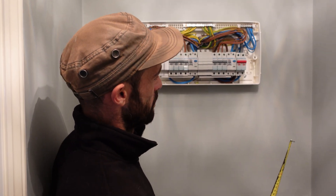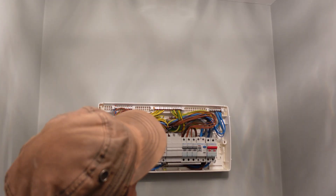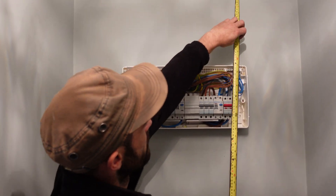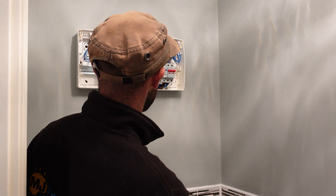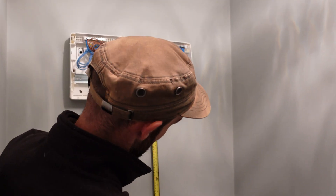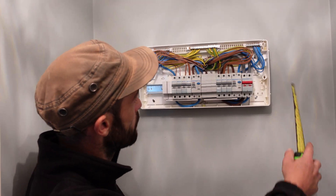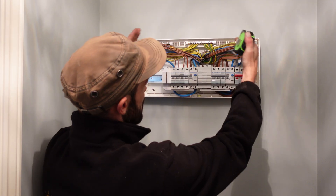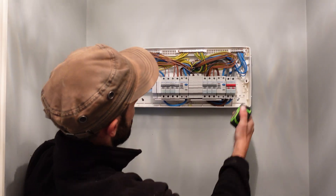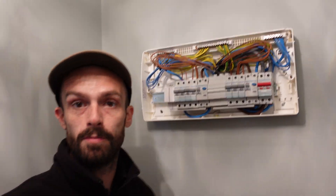In this scenario we'd like to install it above or below — the client has requested above, which isn't a problem. The difficulty we've got is height; we're only dealing with about 430–440mm, and a similar distance below. It's a neat job the guys have done on the original installation and they've left quite a lot of length on the cable. My aim this morning is to lower the board to allow enough room for the gateway to sit above the fuse board.